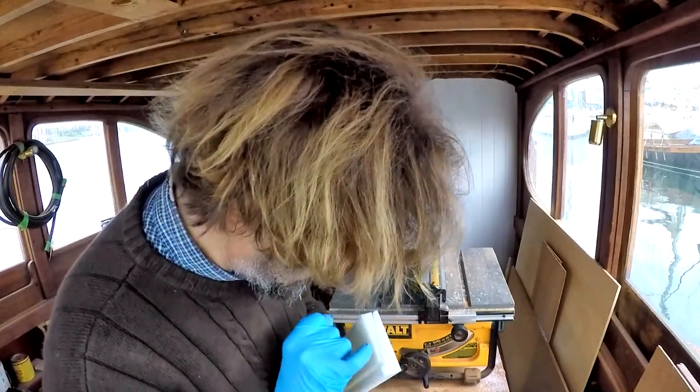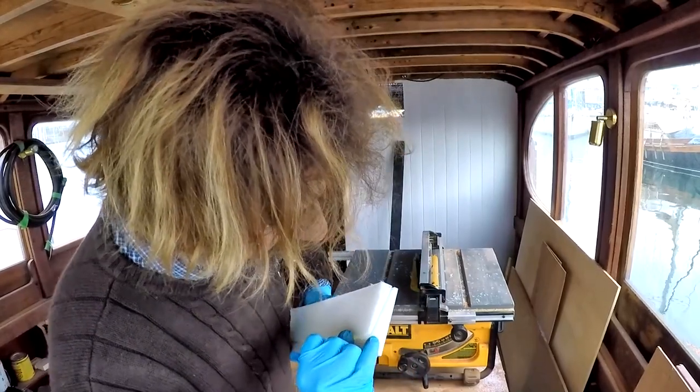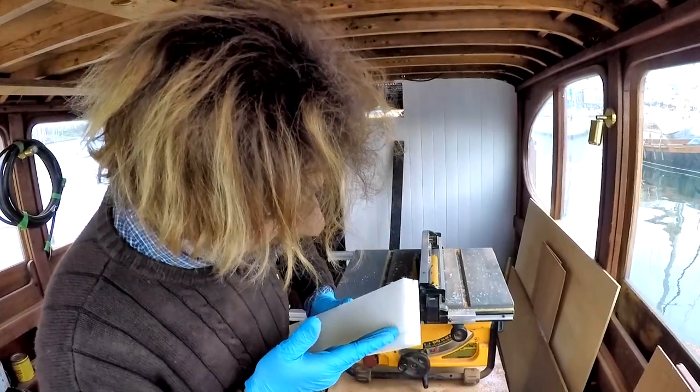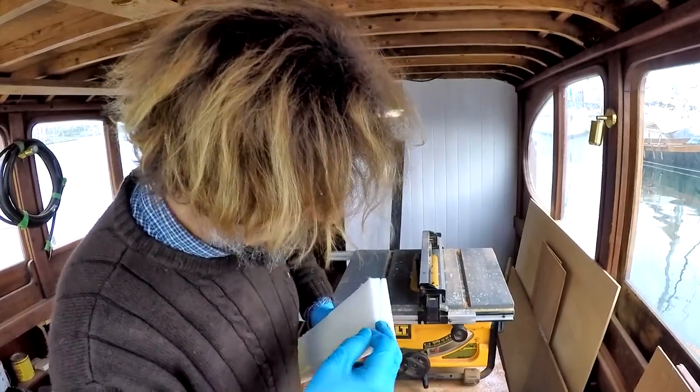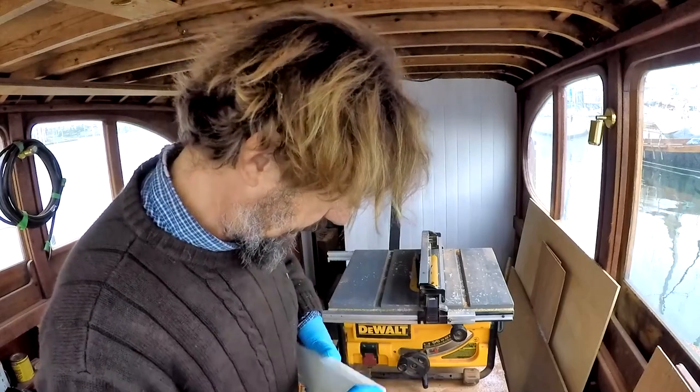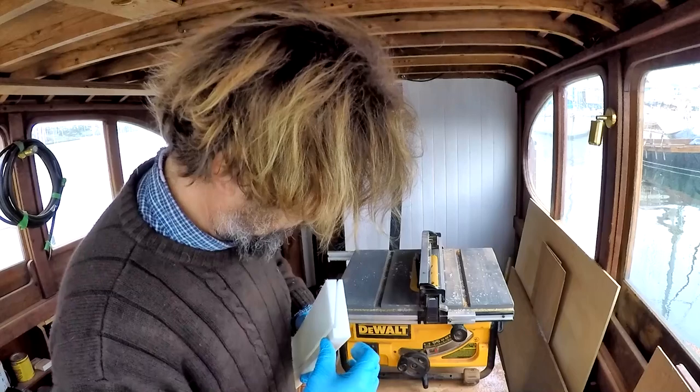That's perfect. I don't know if you can see it, but I had cut with a table saw a flat in the bottom of this trough that the window will sit in. That's a quarter inch deep because there'll be another one out here for the other window. And from the edge of that, I want it to slope out. And that's not too bad for a drip edge. I can still machine a little drip in the bottom of that.